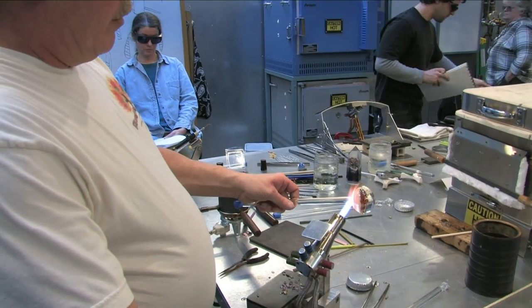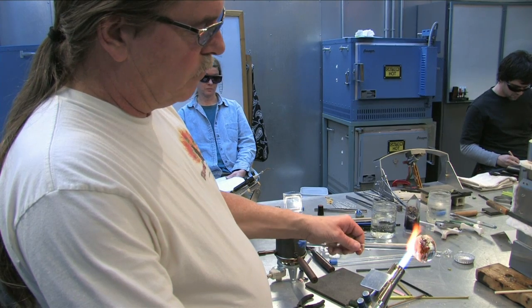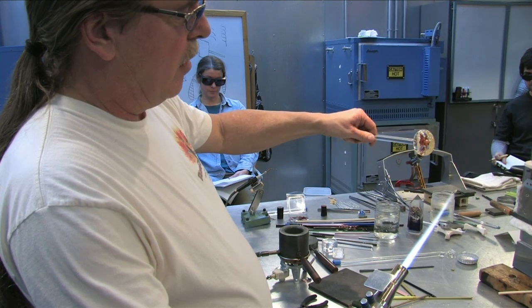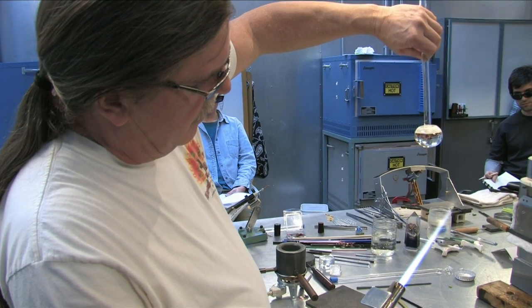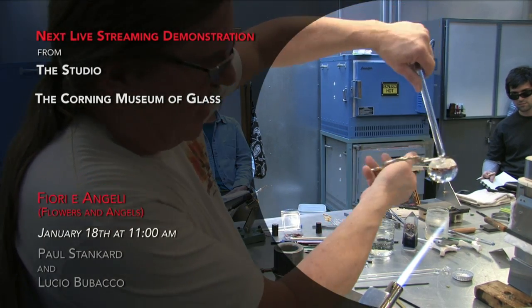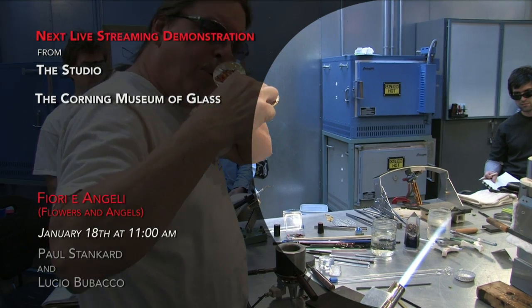This is kind of a dangerous move in that you hit the Pyrex and you want the Pyrex to release itself without falling. So you heat this where it wants to fall. You see, it wants to fall. So I heat it, I hold it upright like this and let it fall until I can actually see a seam between these two glasses. There, you see that? See the seam? You go between here and you catch it like this. You lean it forward.